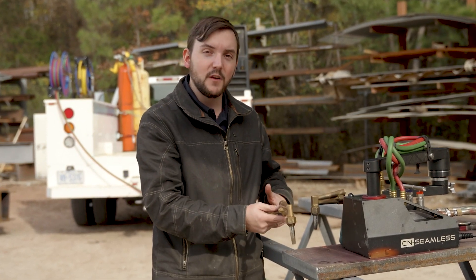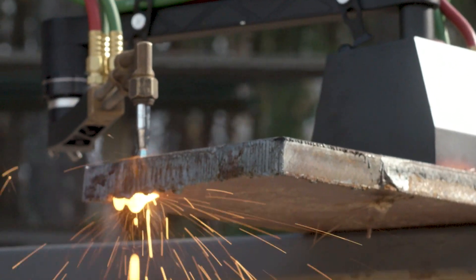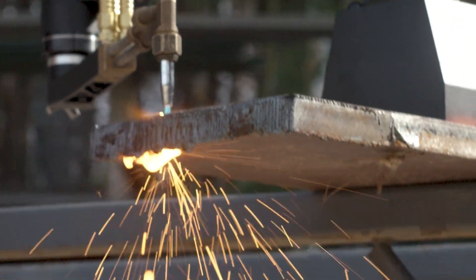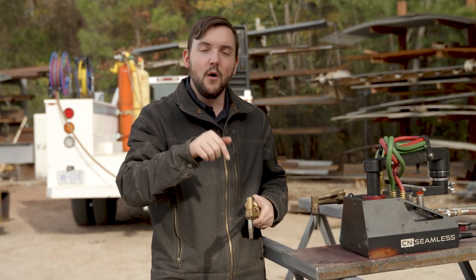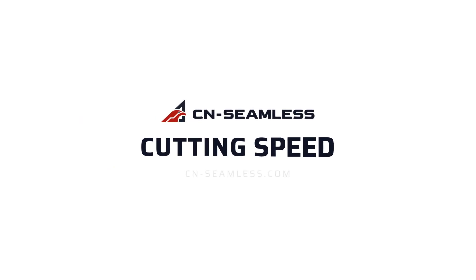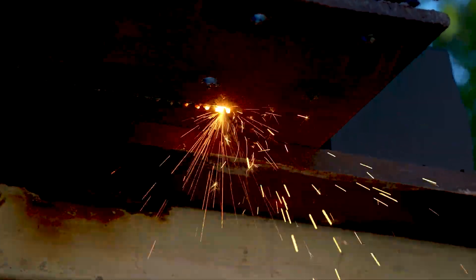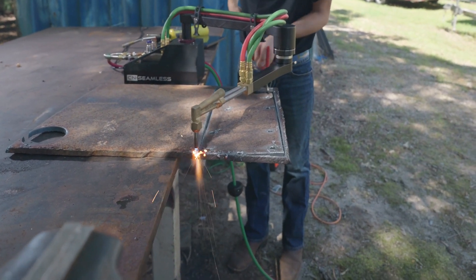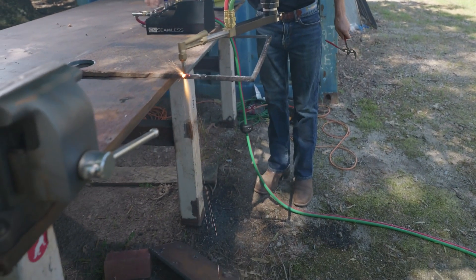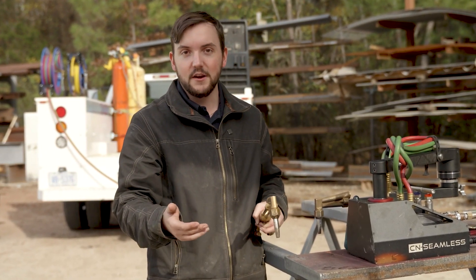You don't want the torch too high or too close to the surface. Keep your torch so that it's just above the blue cones on the material — you don't want the blue cones diving down while cutting or you'll gouge out the material along that path. The thinner your material, the faster you'll have to move at a continuous speed — that's called the feed rate, which is automatically set with the Mach 1. Make sure you're moving at a nice continuous rate so you get a clean path, not hanging around too long so the material welds itself together, and not going so fast that you lose your cut and have to re-pierce.